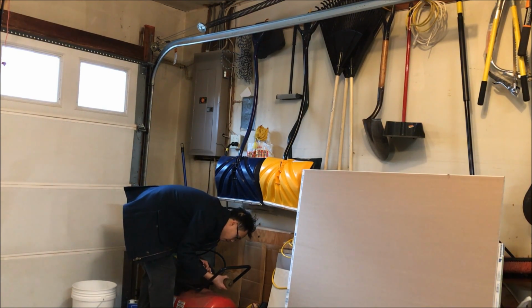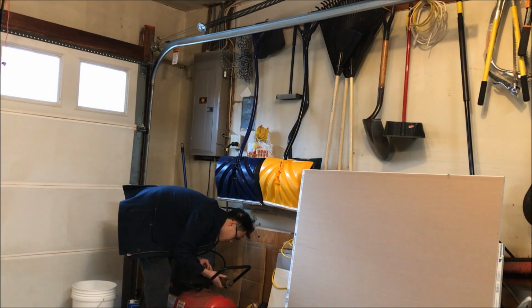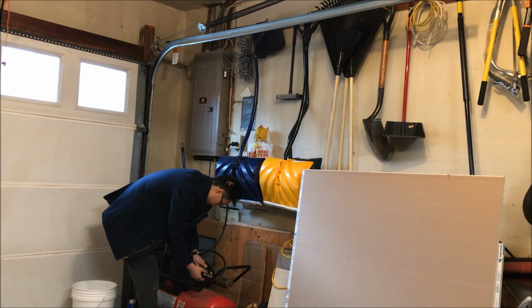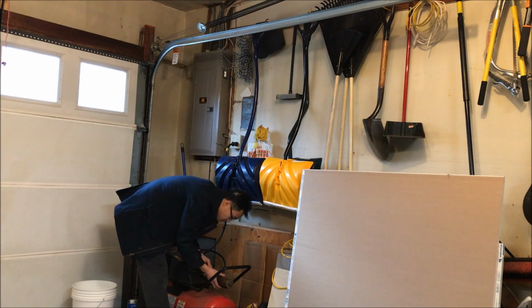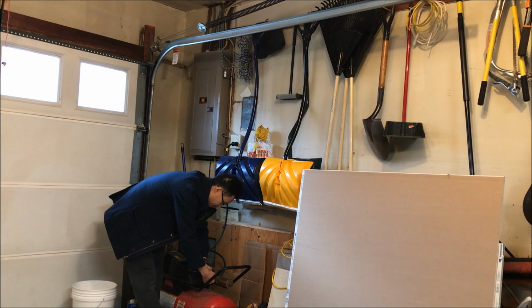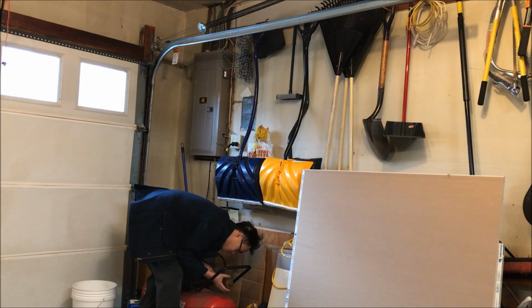This one doesn't like to blow on high pressure. When I tested it last time on low pressure, it sounded okay. See if I can replicate that. So we're going to lower the feed pressure from 125 to about 75 and see what that does. It doesn't bode well if I want to put this on 1689. I've lowered the feed pressure to about 60, so this blows well on 60 pounds, but I don't know why it's not. It's got to be something with that deformity in the bell. I'll have to take a look at this more when I get up to Brantford, but this does not bode well.